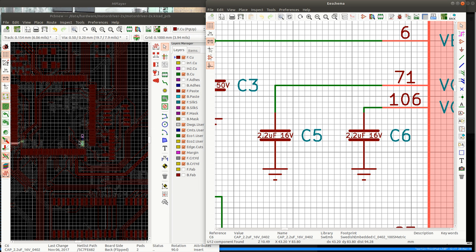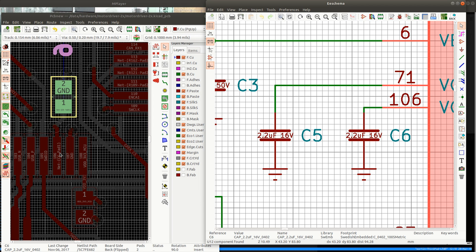Doesn't seem to be connected. Because it's the third pin, right? From the edge. Yeah, it's supposed to be the third pin. And it doesn't seem to be connected to the capacitor. Well, maybe it's connected, but maybe I'm measuring on the wrong side. Let's see. I think I'm measuring on the right side. Oh, no, yeah. That one's connected, and C5 is probably also connected.